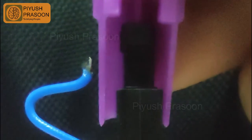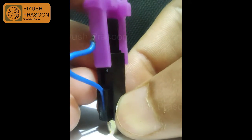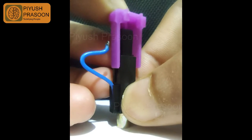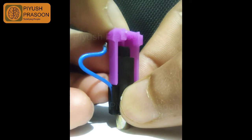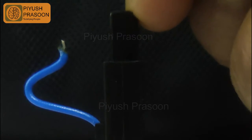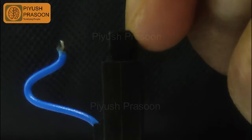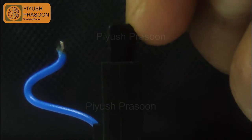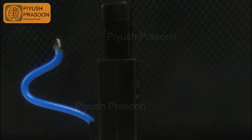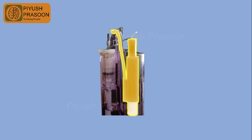You can see in the video very clearly — even though I have placed a plastic wall between the push button and the wire, still the spark is getting generated between the wire and the push button. Let me take another angle so you can see the spark is clearly getting generated between the wire and the push button. Now let's move a step ahead — why is the push button working as a negative potential?